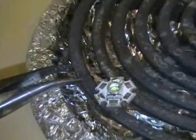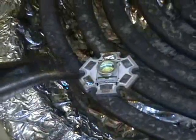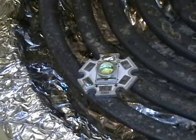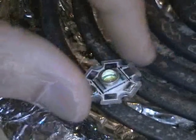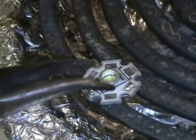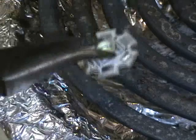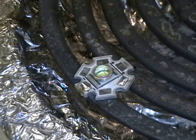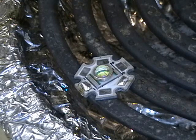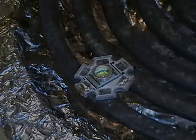I'm going to try and zoom in as best I can here without frying my camera. You'll start to see the solder start to bubble and percolate — that's when the solder is starting to reflow. Position your needle nose pliers over the LED, pick up the LED off the star, and place it on the ceramic tile or ceramic surface. Then take the heat sink off and let that cool on the side as well.